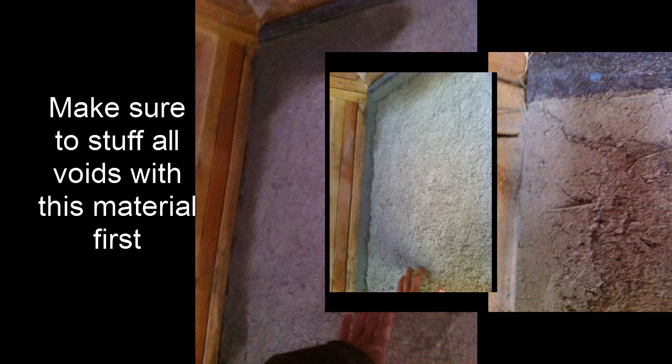The test was successful. Two days later, when we were ready to plaster the wall, the bevel was completely dry with no voids along the adjacent materials. It was easier to plaster up to the edges because I didn't have to think about making a straight line. It was already there.